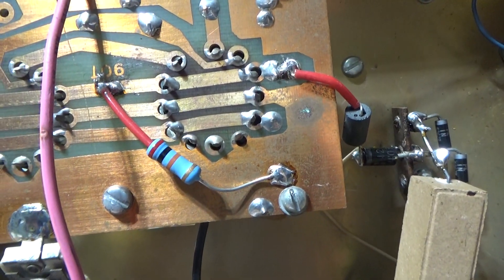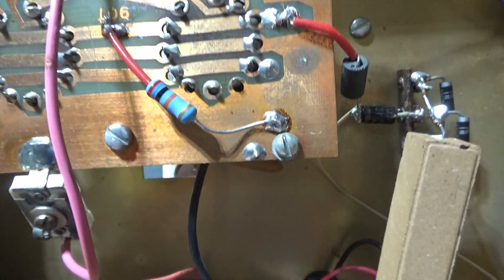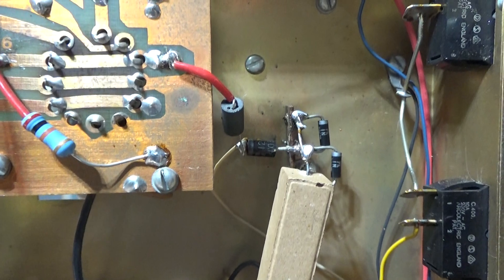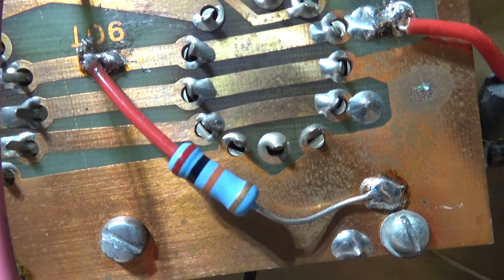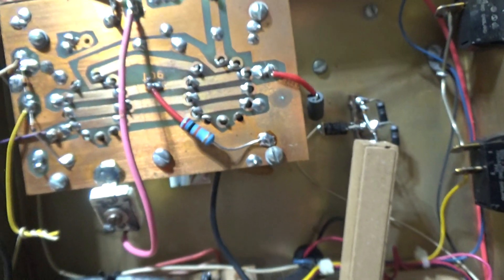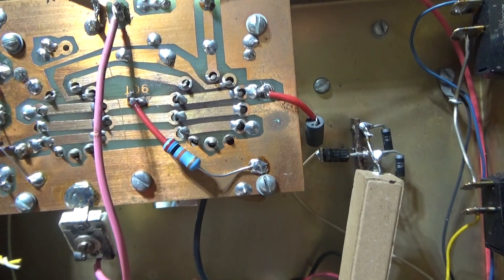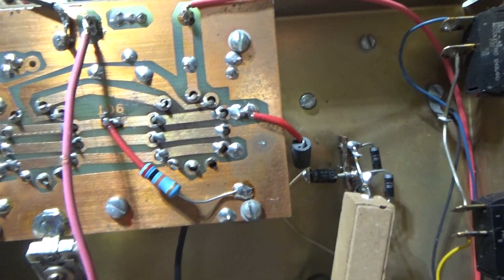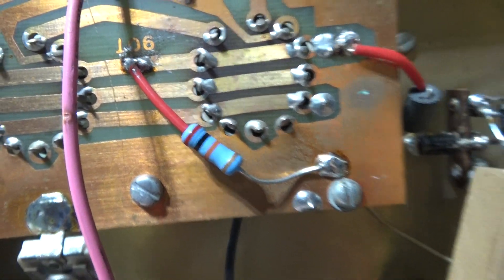One of the problems on this amp is it's a tetrode amp — I call that turbo-charged — and it's got voltage on the screens instead of grounded grid. You don't want to leave those screens and the voltage just floating around. So somebody, maybe that guy, put in this resistor here — looks like a 10K resistor — and that goes to the screen voltage. It keeps that screen voltage clamped down, kind of like a heavy bleeder, keeps the voltage from fluctuating too much, and gives reverse-current and surge protection on that screen voltage. That's a good mod.